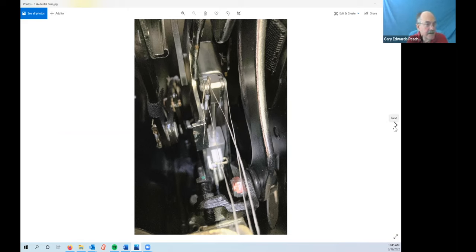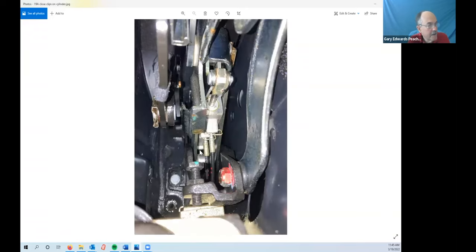Pay attention to the orientation of these hydraulic clips — this is another thing that's good to take pictures of. You can see how close the head of the clip is to the bracket here; if it was put in the wrong way there wouldn't be any clearance at all. Some of these mounting lugs for hydraulic lines are offset to one side or the other, and you've got to be very diligent about ensuring these clips go back the same way they came off, or you could end up not having enough room for them.